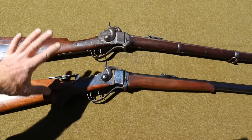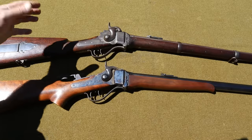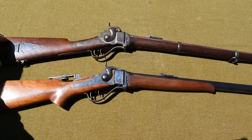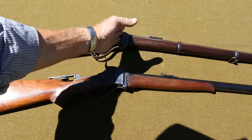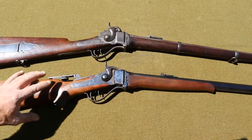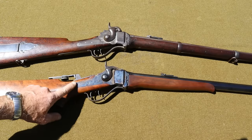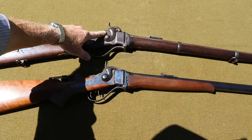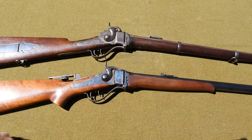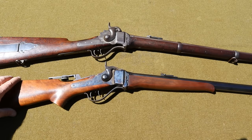You can see a lot of the features are very similar between the two rifles even though they're made 120 years apart. The early Sharps really weren't changed much in design from the early pre-1859 models - they had a slant breech to begin with and then made it more vertical. We go from paper cartridge to brass cartridge, and the design stays very similar. One of the big changes is that we've got a pistol grip stock and a Lawrence pellet priming system for the percussion, which of course we don't need when we go to brass cartridges - but a very similar, great design that's withstood the test of time.